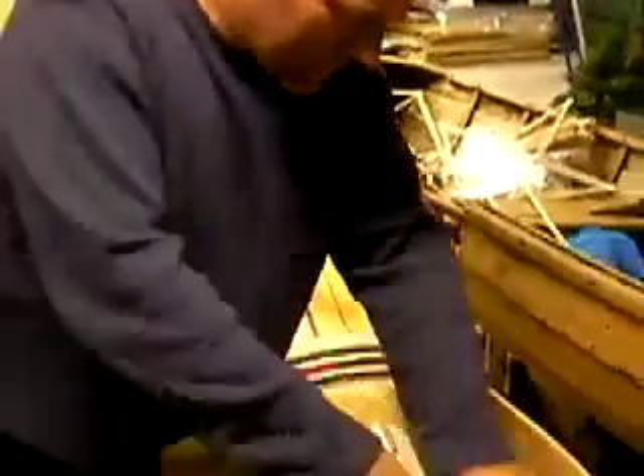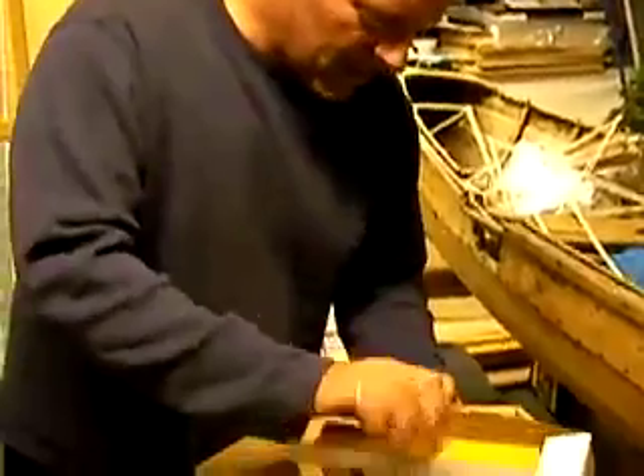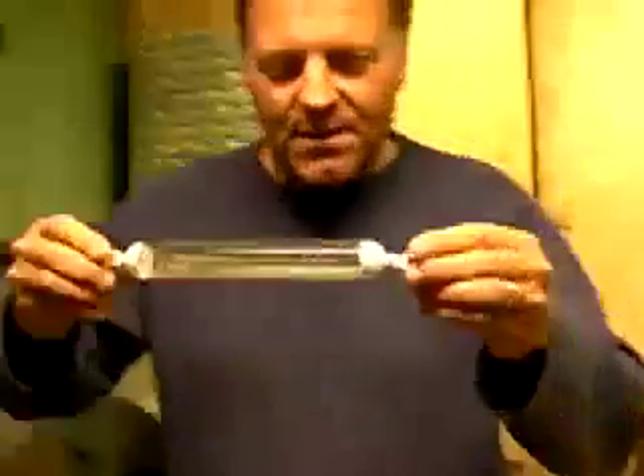So these are 5,000 watts. What does a bulb look like? I got a whole box of them that came with it. They actually have some different wattages, and a couple of them are brand new. This is a new one, which you're not supposed to touch. And you can actually see the droplets of mercury inside — you actually can. This is a high pressure mercury vapor lamp.